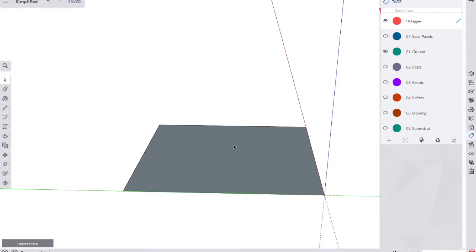The array will be tilted at 27 degrees — that'll be the slope of it. That's not exactly our latitude, but it is based on a formula derived from our latitude. There's a formula to figure out that optimal angle, and mine works out to 27 degrees.